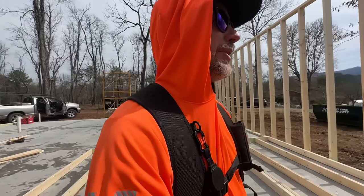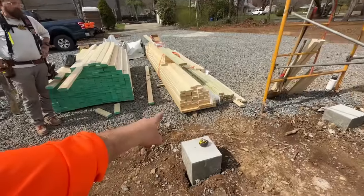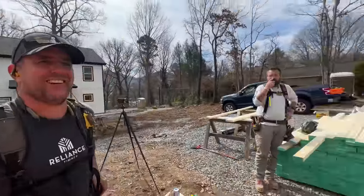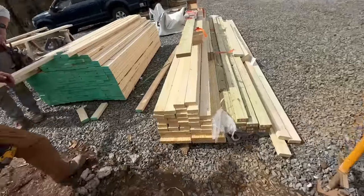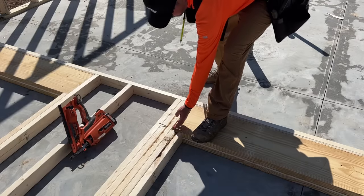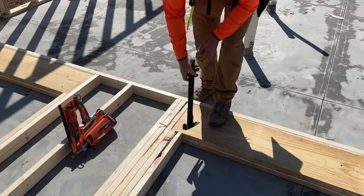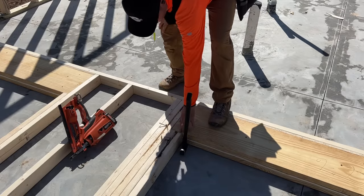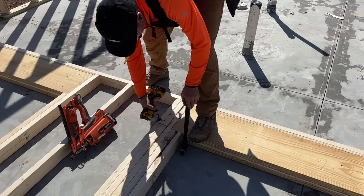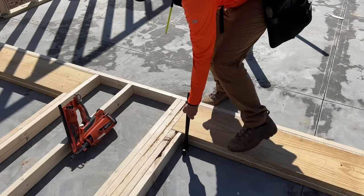Good news and bad news: good news is it's only 30 minutes to lunch. Bad news, we need headers and the cut guy needs them, but they're at the bottom of the stack. A lot of these headers fall a little low to the studs, probably because we crowned the studs up. We want to be really particular that we flush them — I get my claw in there and make sure we're flush on the face before I run either a screw or nail. I'll run a screw first to suck everything tight, then nail it off.